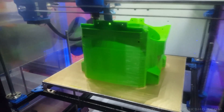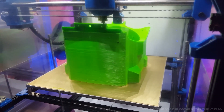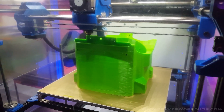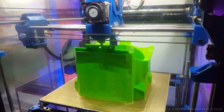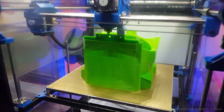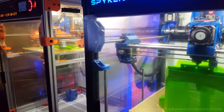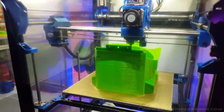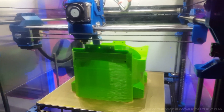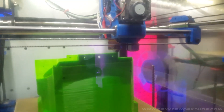I don't really know what's all out there. But if you're going to print your own giant snowblower or snowcat, you need to get your nozzle to print 1.2 millimeters. If you guys try to print this with 0.4 millimeters, it's just absolutely awful. The print times for the entire snowcat with a 1.2 nozzle is like 200 and some hours, which honestly isn't that bad. If you print that same thing with a 0.4 nozzle, you're talking literally close to a thousand hours of print time, which is just stupid. Please upgrade your printer for a 1.2 nozzle.